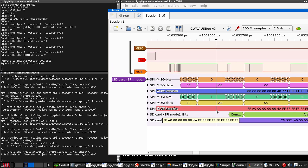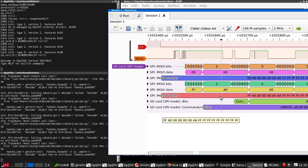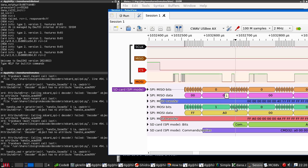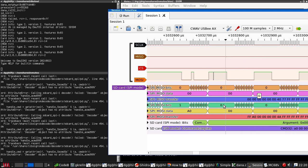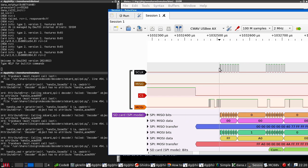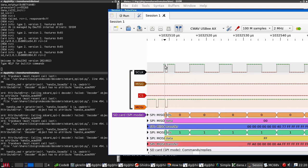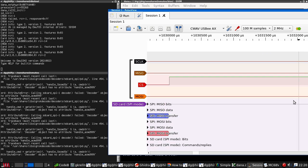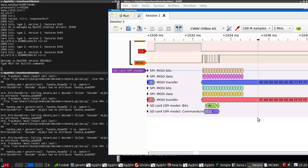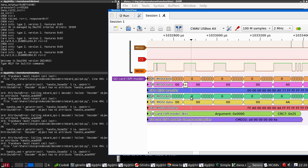Okay, I do not believe this decode is valid. Two, three, four, five, six, seven, eight. Yeah, it's not valid. It somehow thinks there are 7-bit bytes. I think it's confused by this glitched clock there. And again, see my earlier comment about expecting to see more dummy bytes with chip select high, which seems peculiar, but